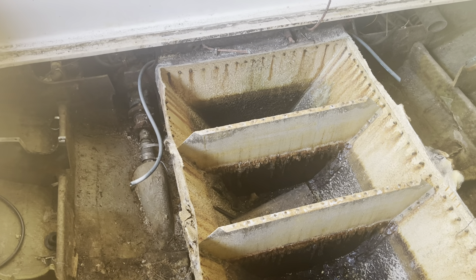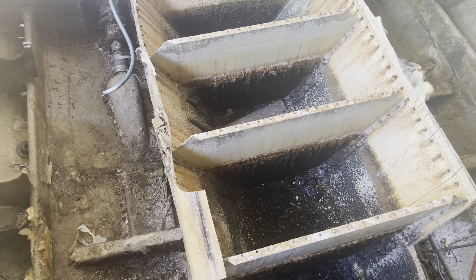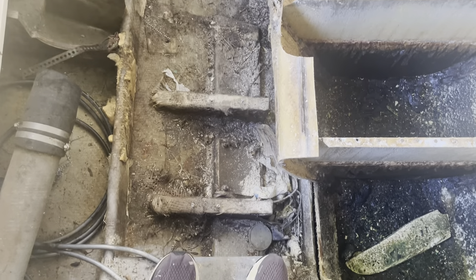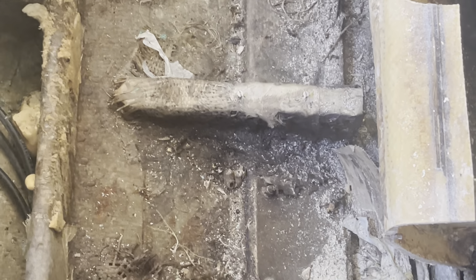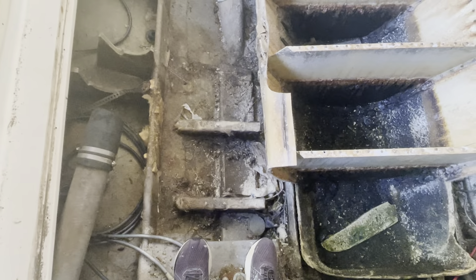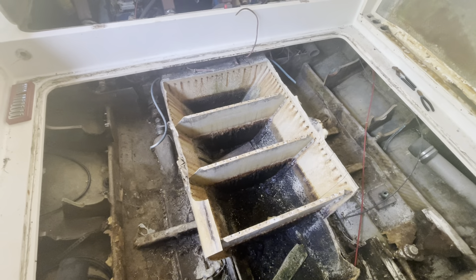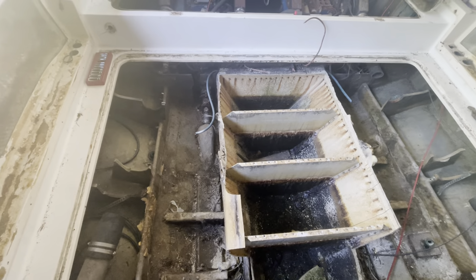As great as people say these Bertrams were when it comes to fiberglass work, there's some fiberglass work in here that I question. Some stuff was actually put in after the boat was built, such as where the saddle tanks sat — that glassed-in area right up in there. Pretty much if I take a good maul to it, it just peels right up. As far as the fuel tank goes, I want to come in here maybe tonight and knock out these baffles — I've got a rubber mallet so I don't cause any sparks. That'll be my goal for this evening.